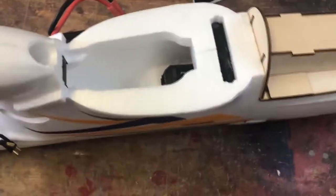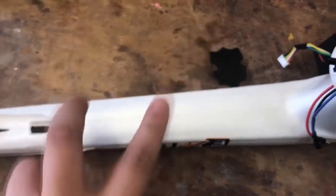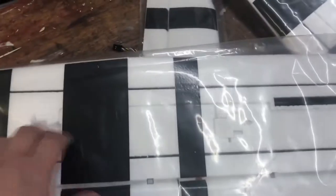What I've learned, mostly from using these systems on hexacopters and quadcopters — DJI Naza setups — is to keep the GPS well away from this other type of video transmitter, as it can occasionally blast out and cover over the GPS signal. So I'm probably going to have the video transmitter up front and the GPS somewhere further back. The 433 antenna is going to be here — there's not really a lot of room to put stuff, but it'll work fine.